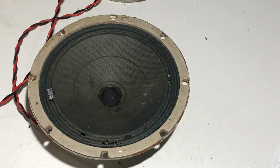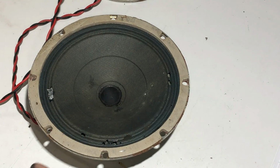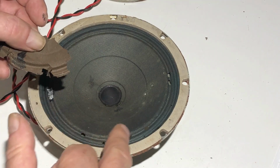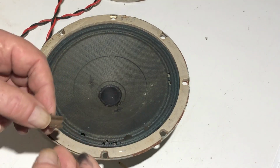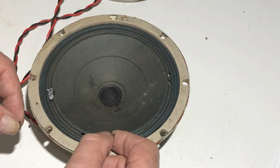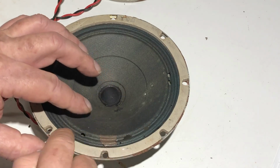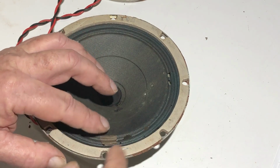That said though, I will just paint a little bit more of that over the top. I might let that dry first. And I'm going to go around the other holes and do a similar thing. For this larger section here, I've got a piece of old speaker cone that I'm going to cut up and put over that as a patch, because the contours on the edge of this will match the profile in here. Yep, that matches pretty closely the contour of the speaker, so I'll use that to patch that bit up because that's a tricky bit. The rest of them I'll just use tissue.